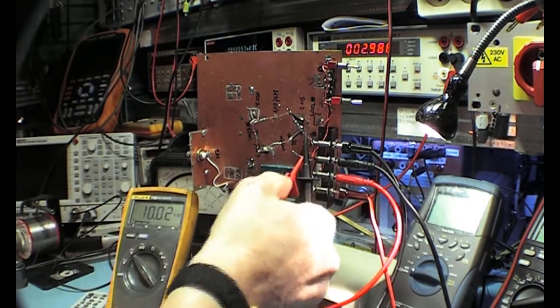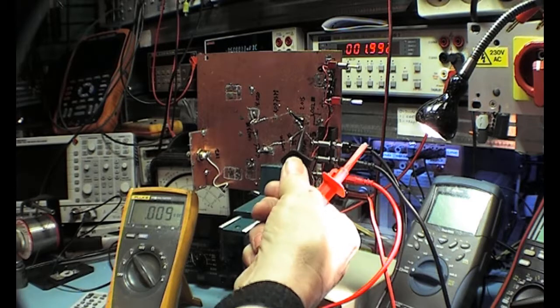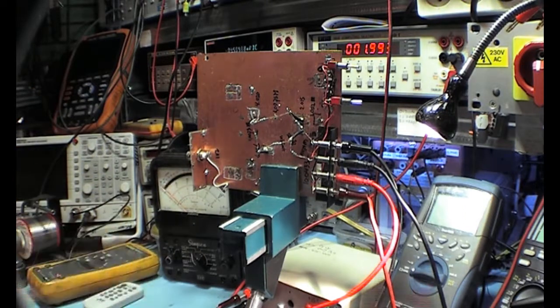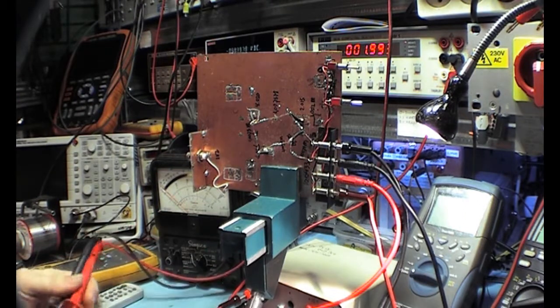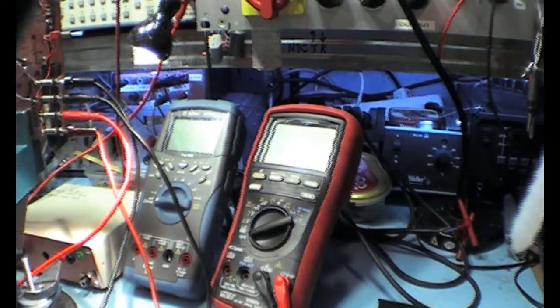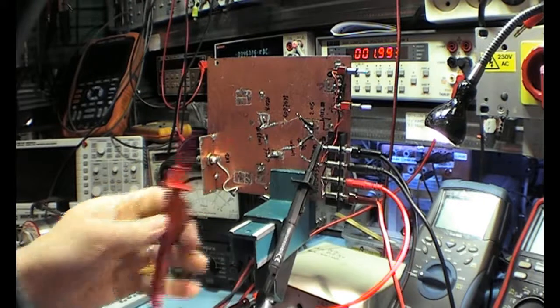There's a possibility. It's not always the case, because there's still the same current running through that, but the power supply has to supply more, because current flows everywhere. But what if we take a modern meter with a very high impedance, like the Keithley, that is more than 10 gigaohm up to the 10 volt range. Some are like the Brymen here, and that is also a very high impedance, but only in the millivolts range. And we're working here in the 10 volt range.